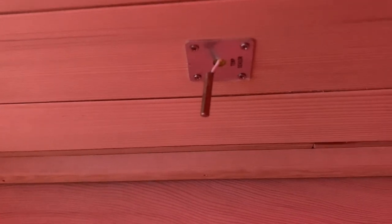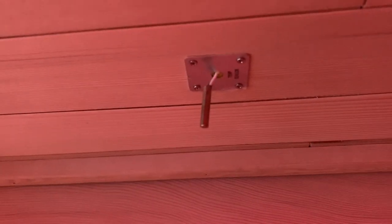A couple of other things around the cabin — up at the top you'll see a little silver temperature sensor. That's what's measuring the temperature which registers on the control panel, so try not to fiddle with it — just leave it as is. There is also a vent next to the temp sensor to let a little air out. A tip: if you leave the vent open, you'll actually work the sauna a little bit harder, because it lets some hot air out around the temp sensor, so the sauna will think it's cooler than it is and the heaters will stay on a little bit more.